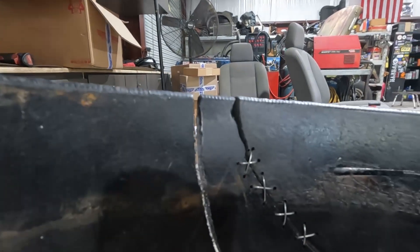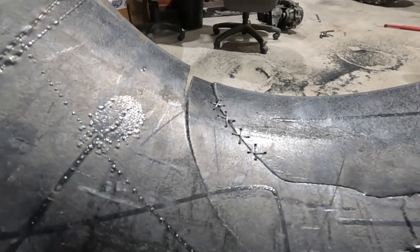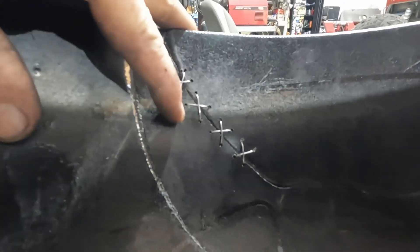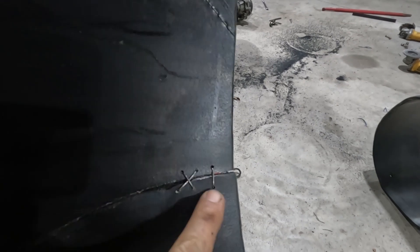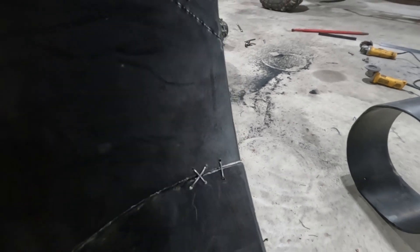I've gotten started — I'll show you what I did so far. I've got those four done. I'm using a cross-hatch pattern because as this moves I want tension going both ways. If I just do one straight line, it will let everything move back and forth, whereas the cross-hatch pulls against itself and won't let it move. The first one I did was straight just to hold it, but this style is much better.